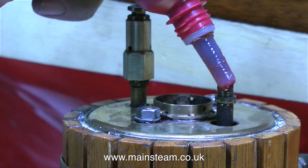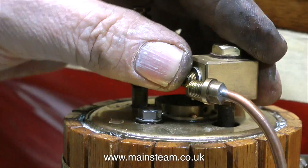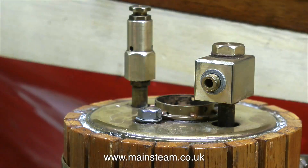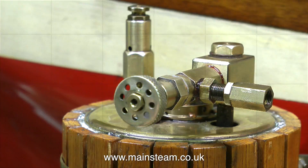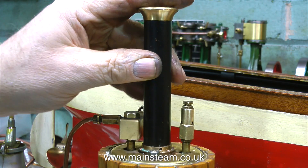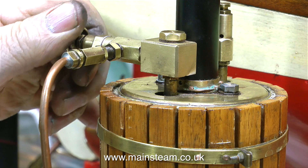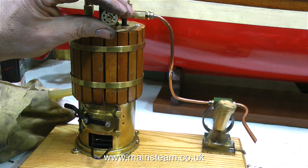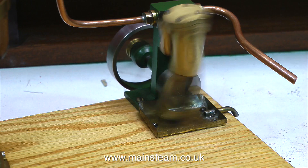As this next bit is a very simple process, I'll speed up the video. I used Loctite 542 on all the threads. First I refit the main turret, making sure it's in the correct position, and tighten up the lock nut to hold it there. The valve goes in place, and finally I refit the engine and bolt it down to the bed plate. I refit the chimney to make the plant look better. With the compressor connected, it's now blowing off at 20 pounds per square inch, and opening the tap lets air to the steam engine — there are no air leaks anywhere, and the handwheel on the valve works so I can regulate the engine speed with no problems at all. Thanks for watching, and I hope you found it useful.